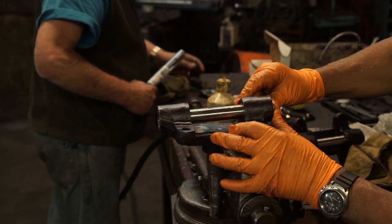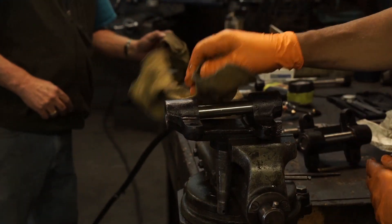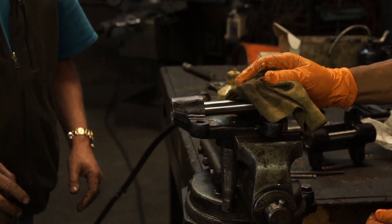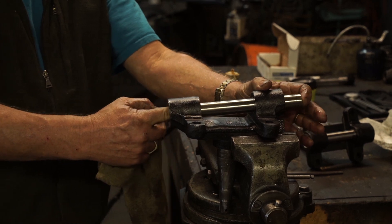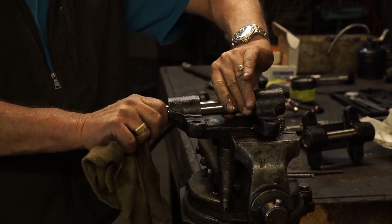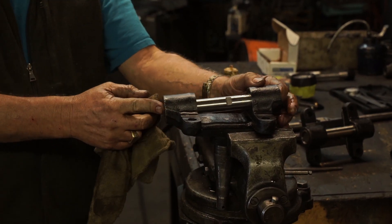This is all done by hand. Secure the spindle in a vise and lubricate the reamer as you turn in a clockwise rotation. Refer to the reamer instructions for proper use. A link to the Chadwick and Trefethen website will be listed in the comment section below this video.